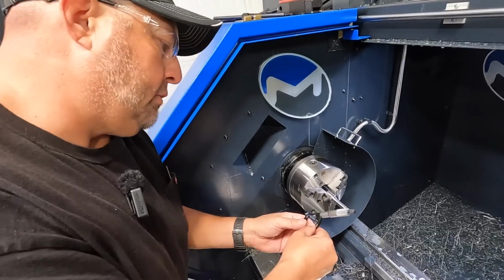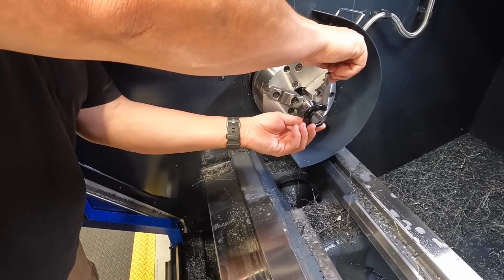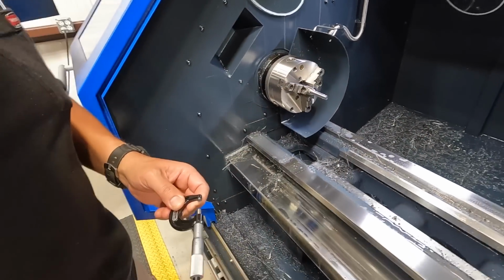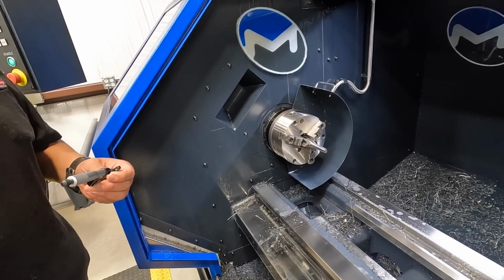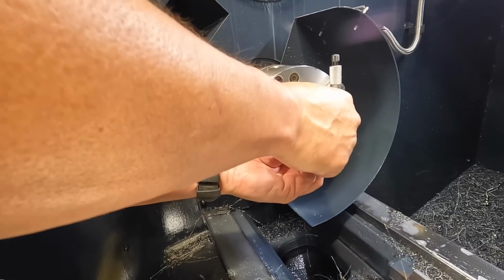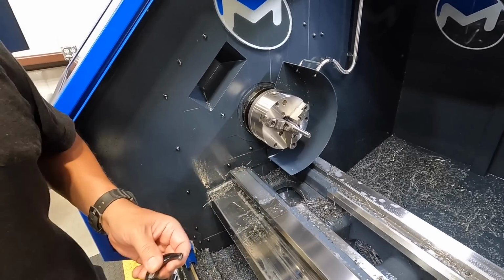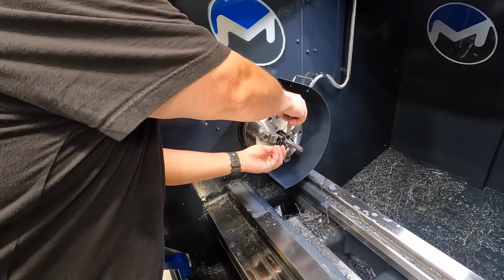and see what we finished our outer bearing journal here. I'm shooting for 0.591 inches, and I'm exactly 591 on the micrometer. So let me go ahead and measure the, oh, sorry about that. That's going to be 649 is what we're looking for on this journal right here. 649 on the mic. I know you guys, it's hard to see that on the GoPro, but we're on 649. And then our last journal, I'm trying to remember now, is 17, but we want 0.670.